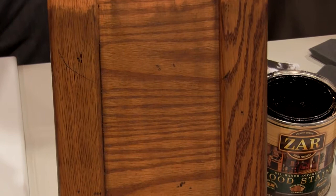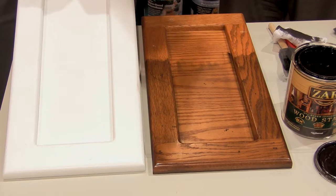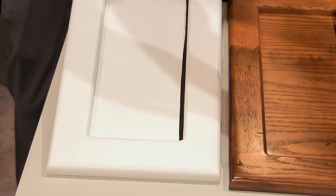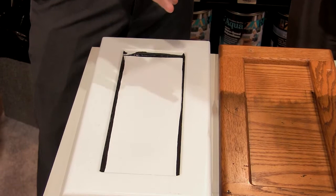So that's a door with a stain and a clear finish. What about the painted door? What we're going to do is glaze the inside panel. I use a foam brush and I'm using a darker color stain — you can choose any color stain you want as long as it's a little bit darker so it accents the panel. So I could use a chocolate brown or an orange or anything? Absolutely. I like these foam brushes because it gets right in the crack there. Then I'm going to take a rag and wipe off the excess.